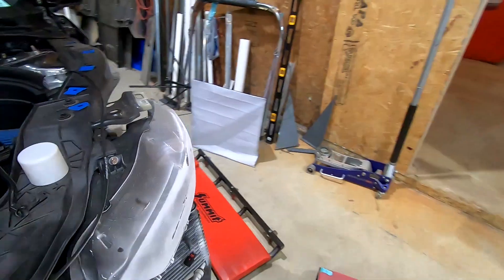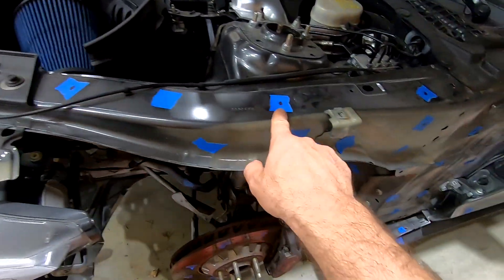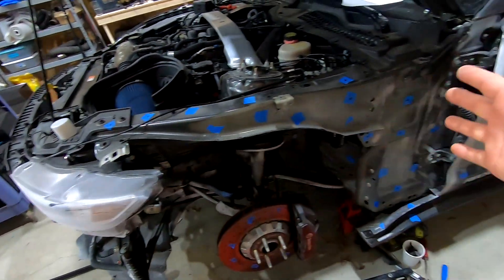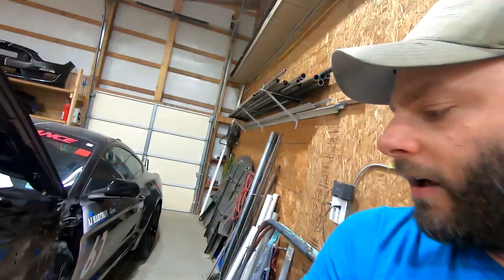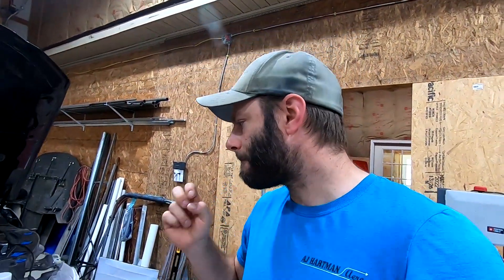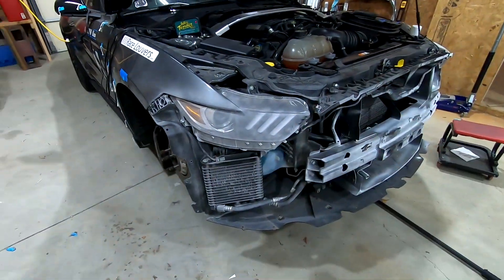On this side I put little pieces of tape with dark circles, and a few I even put X marks. Believe it or not, when I scan this area here they're kind of just like makeshift marker dots. You can buy specific marker dots — I haven't tried those yet, but I'm sure they'd be helpful as well, and they also help you when you go to line up scans.